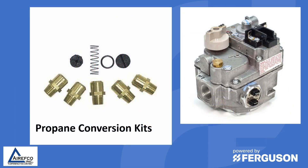We mentioned accessories that need to be installed on certain gas applications. I got a call from a tech who was working on a furnace tripping on the limit switch and running hot. We determined it was on propane gas but had never been converted to propane. There are propane conversion kits that usually consist of changing the orifices for each burner and a spring that goes into the gas pressure adjustment port on the gas valve. Make sure all the accessories for your installation have been done properly and that the furnace is set up correctly for proper operation.